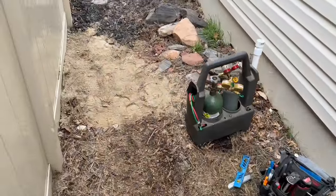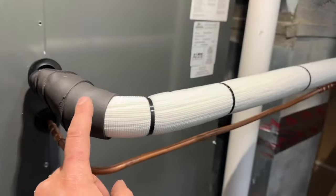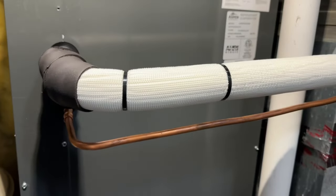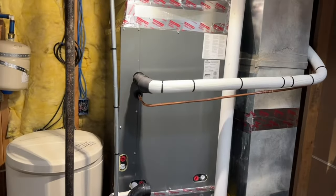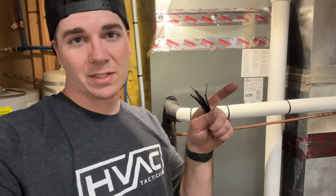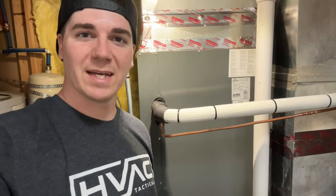They're not the cleanest joints but they sealed really nicely. Let me show you the inside unit after we insulated it — it looks really nice. That's a wrap. Our TXV bulb is right here at 10 o'clock — it needs to be at 10 o'clock or 2 o'clock — insulated with foam tape, and we've got our white insulation wrapped there. We've got our two press fittings, which will actually be a great test to see how long these last. That really saved me from having to make another trip. This install is completely done — all we have to do is pull our vacuum and let the refrigerant in and we'll be ready to rock and roll. If you're interested in seeing the proper procedure on vacuuming a system in less than 10 minutes down to 100 microns, check out the next video where we'll walk you through that process with our NAVAC 4 CFM battery-operated vacuum pump. Until next time, be safe — later!